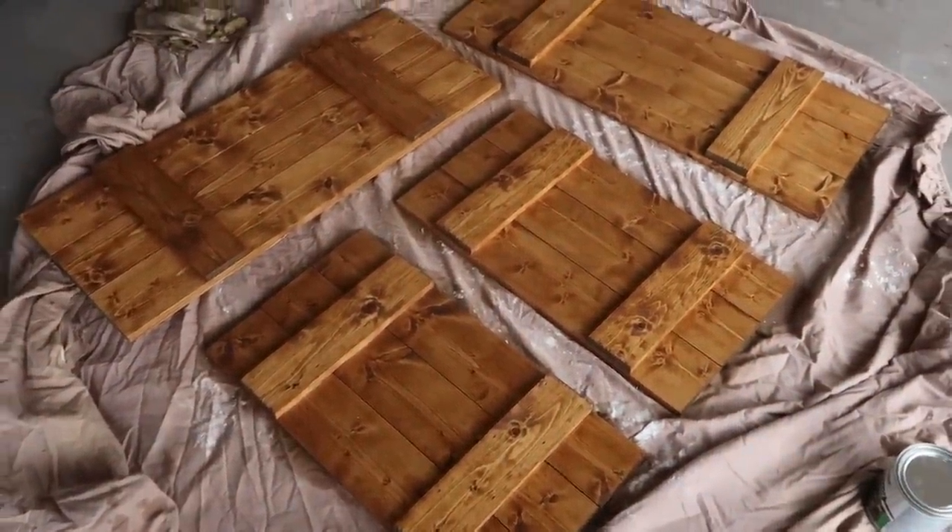I totally recommend a second coat — it really makes it pop. I've wiped these down and I'm going to put the polyurethane on them. What the polyurethane does is put a clear gloss on them. You don't have to do gloss — you could do matte or semi-gloss. But it's going to help protect them from the sun and from water and make them more durable outside. I'm going to let these dry a little longer, probably another hour, then put one coat of polyurethane. I might have to do two. I'll let them dry overnight and if I need to, do another coat in the morning. Then hopefully tomorrow afternoon we will show you how to put them into the brick yourself, which is kind of the intimidating part of all this.